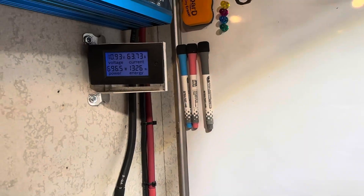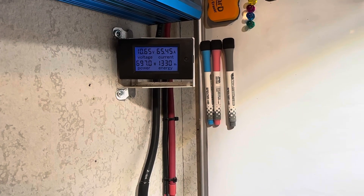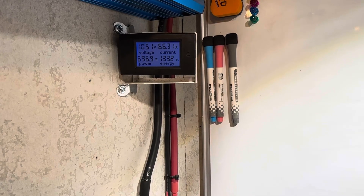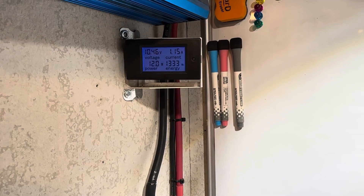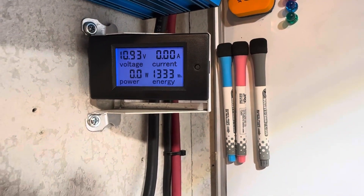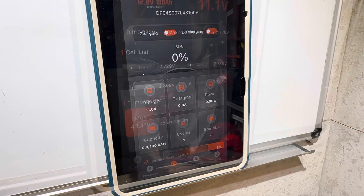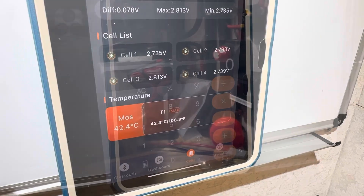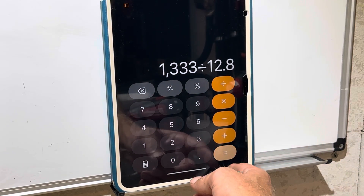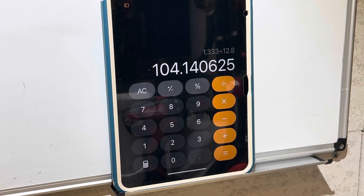The voltage is starting to crash off on the Truvelux. I'll record it live until we shut down either on the inverter low voltage or BMS disconnect. The BMS Bluetooth display just switched over to 0% state of charge at 1,330 watt hours. The inverter went off on low voltage. The tally on the Truvelux is 1,333 watt hours — just a touch over 104 amp hours on the Truvelux. Recording cell voltages immediately after the inverter low voltage disconnect. 1,333 watt hours divided by a nominal 12.8 volts gives us 104.14 amp hours. It's always nice to have a 4% bonus on these 100 amp hour batteries.